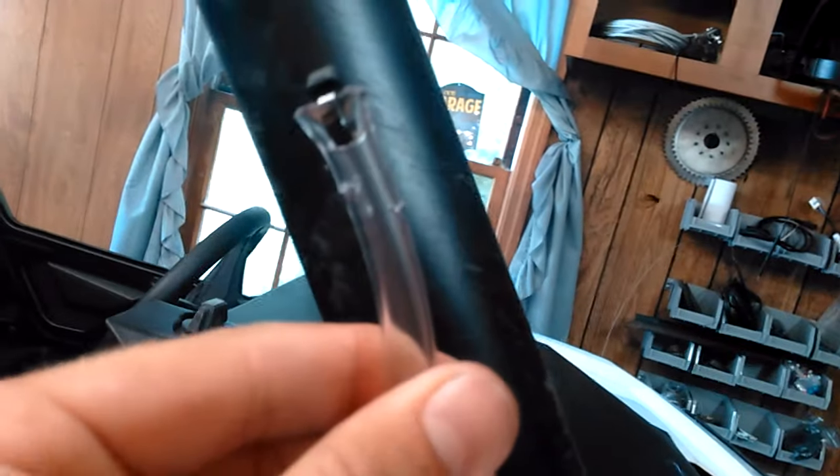You can probably do three or four of these if you're really concerned about having enough airflow. But that way, when it's sitting up in the pipe and water runs over it, it won't go into the line. Also, the way I cut the length, it's going to be pointed up like this. So any water that gets in this pipe will run along the bottom of it, so it should be high and dry anyway.